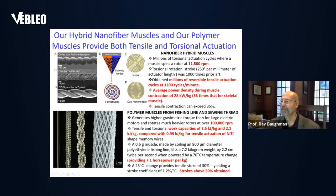Our hybrid artificial muscles, one type, are made by taking carbon nanotube yarns and incorporating a guest into them. We can simply infiltrate this guest into our carbon nanotube yarn, or we later insert twist into the yarn. If we just use twist, we can make torsional artificial muscles, but if we want to make tensile artificial muscles, it's best to insert so much twist that you get coiling.